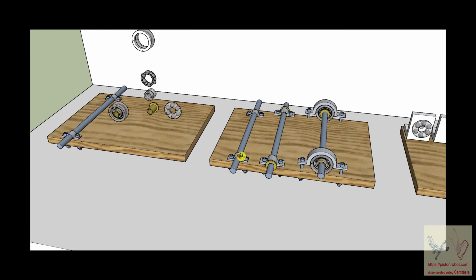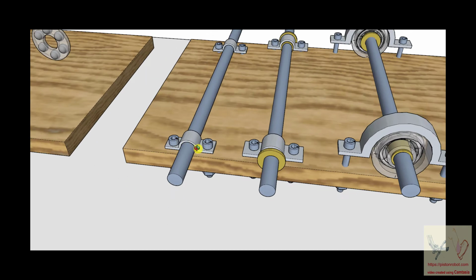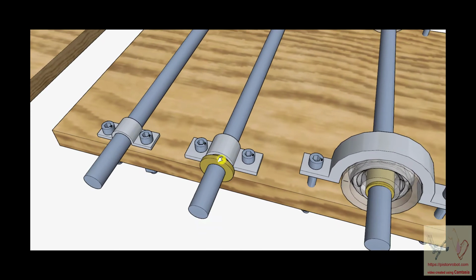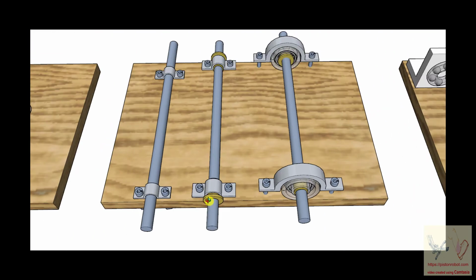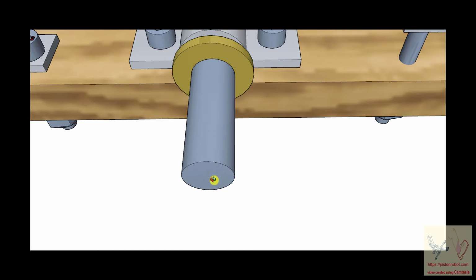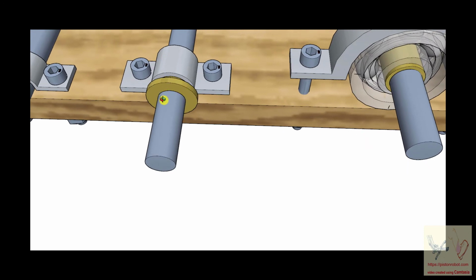And what happens is you start out with this, which is a bearing. It'll work. It's a bad bearing. But it's cheap and inexpensive and clever and simple. But you could put in these brass or bronze oil impregnated bushing bearings. And now this isn't moving. This bushing isn't moving. This shaft is turning around. The shaft is rubbing on the bronze, and the bronze is made for that. And the bronze slowly wears down, but not very fast. It releases oil, and you have the motion of one metal against another metal occurring where you wanted it to, instead of this metal rubbing against that metal.